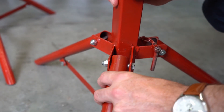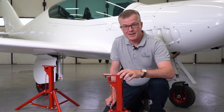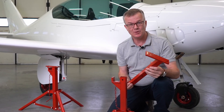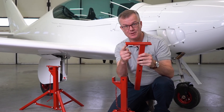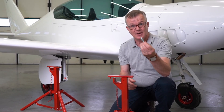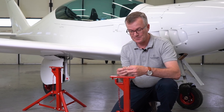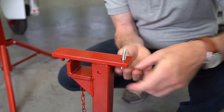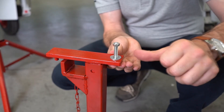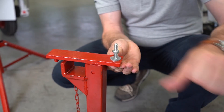Just to emphasize, the leg should be free to move a few millimeters. If the whole tripod stand has been disassembled, to reassemble it make sure that this vertical pin rests over the jaw. This leveling bolt and nut assembly is assembled by pushing the bolt up through the hole, placing the washer over it, and then screwing it down just about halfway to start off with. We'll talk more about that later on when we come to leveling the aircraft.